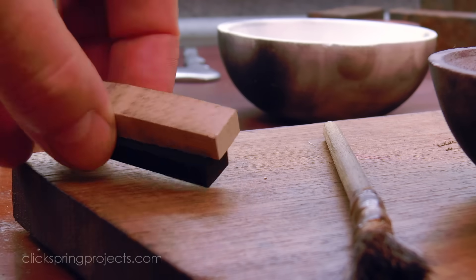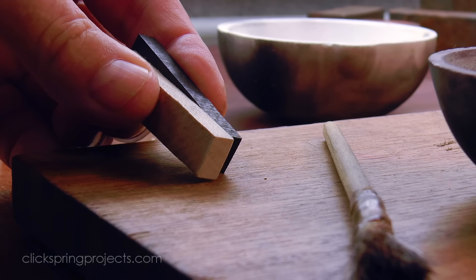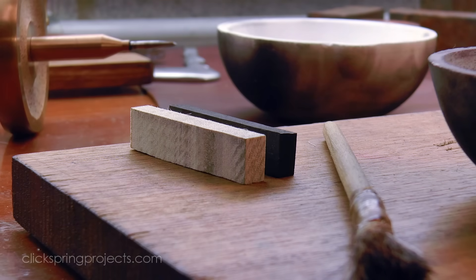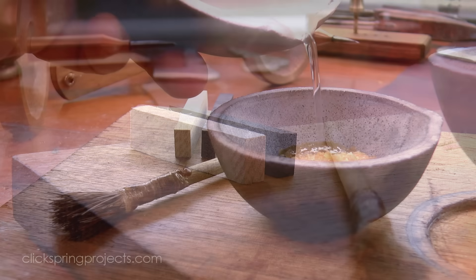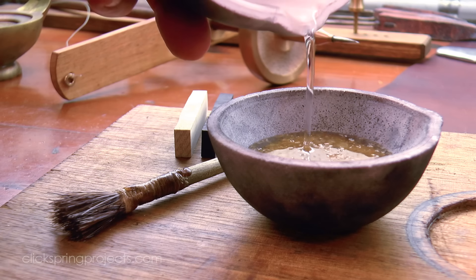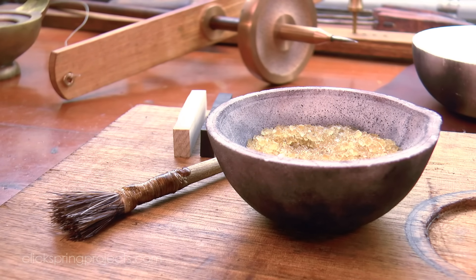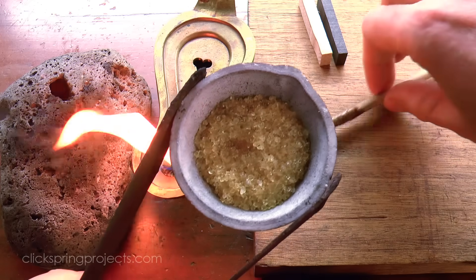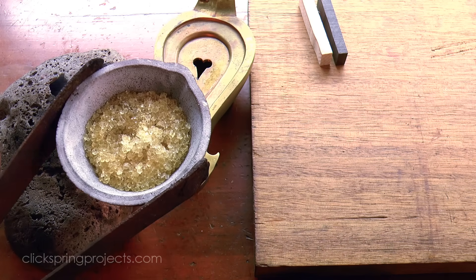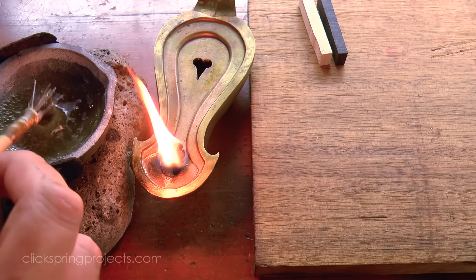For example, there's more than a few ways to achieve a two-toned sphere representing the moon, and we can imagine the maker pondering how best to make this part. No evidence of the materials used remains, but it certainly needed to be light. As an experienced operator of the lathe, one option open to the maker was to turn the sphere from bonded slivers of light and dark wood, with ebony and holly being reasonable candidates to give a clear terminator between light and dark.